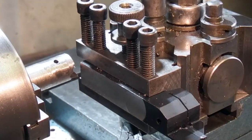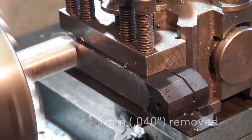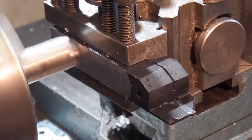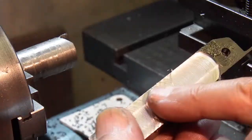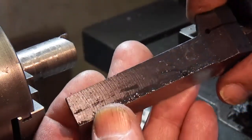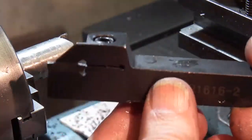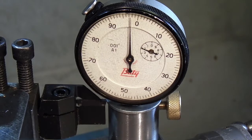The finish is quite good. Feels flat — it looks worse than it is. I'll just file the sharp edges off and we'll see if I can get centre height on that. Using the height setting gauge you can see it's just gone off zero, top of the tool set at centre line, and I've got probably a millimetre clearance under the tool.